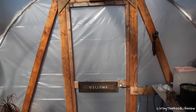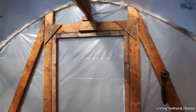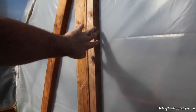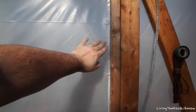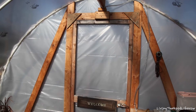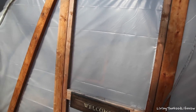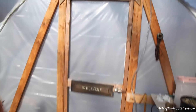I had a special request to go over the design of my door. It's very straightforward. It was just 2x4s that I ripped — ripping means cutting horizontally across the entire length of the wood — so I cut one and turned it into two. This is the same board on both sides, just cut in half, so I was able to get two 2x2s. You can also buy 2x2s, but I find they're usually warped and hard to work with. This way it actually stays square — there's not really any bowing or warping at all. I used the same thing on the ends, cut two of them, and used one whole one in the middle. I put them together with outdoor wood glue and screws, and it made a perfect, simple door.